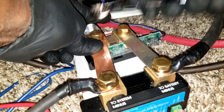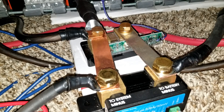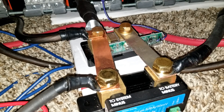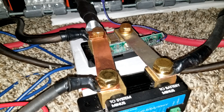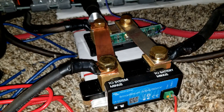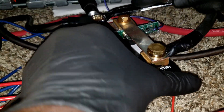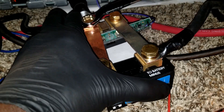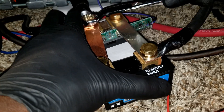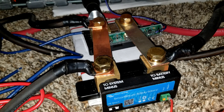The batteries we are using here are the Volkswagen e-Golf batteries. It's like 1075 — I forget the exact number, I'll put it in the description. You can go back and look at my twin towers Volkswagen e-Golf video by JW Solar USA to see exactly what I'm talking about. Each battery is 75 amp hours and I have 12 of them, wired six in parallel and six in parallel in series for 24 volts.